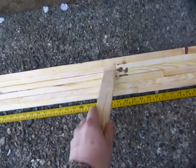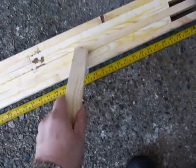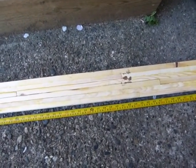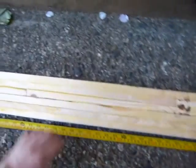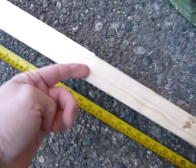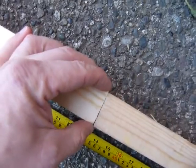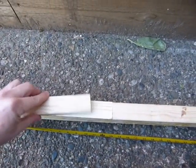The second overlap is in the next one, the third one is there, and the fourth one is there. Every stick is shorter than the finished length of the shelf, but this is one way you can join wood. The joints here — the wood is not going to be joined at the end, and if it's a little gappy I don't even care, because the glue is holding it from rotating.